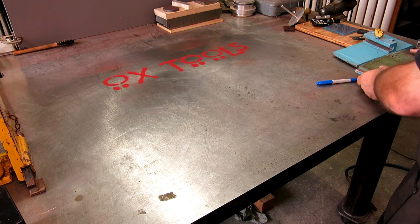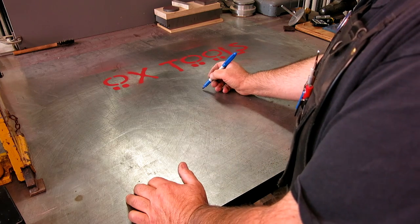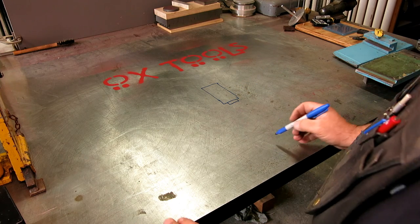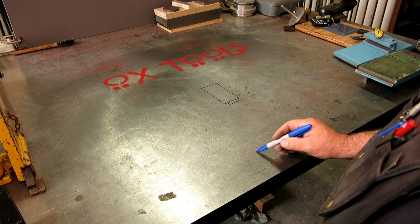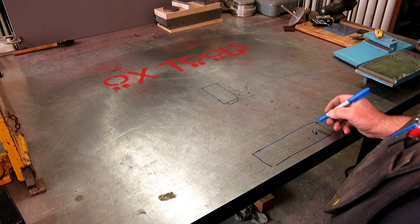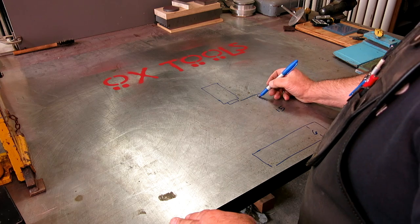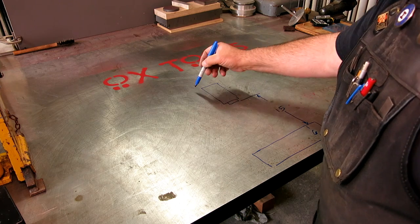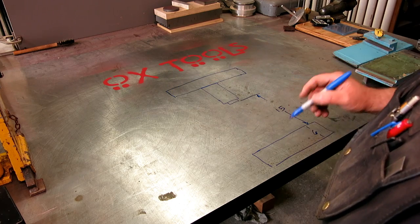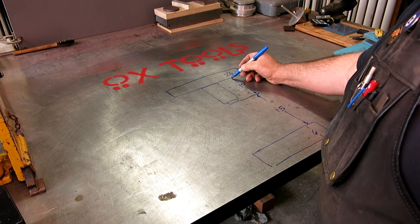That's what I would call our open height. All right, we're just gonna do some chicken sketching here. Here's our ram, okay? And then here's our platen surface here. And the base is gonna be the 6-inch tube, and we said we want 15 in here. So we're just doing a stack up here. And then we got our mounting surface here, and those are gonna be those bars that are up in the rack. And those are 2.5. Okay, that's 10. You see what we're doing here, right?